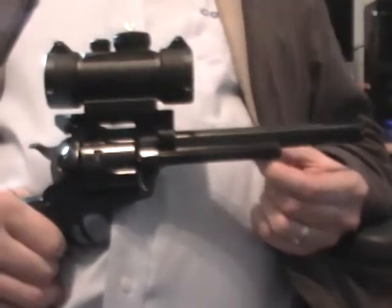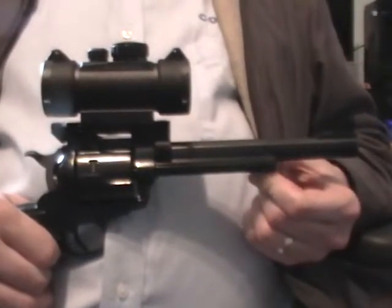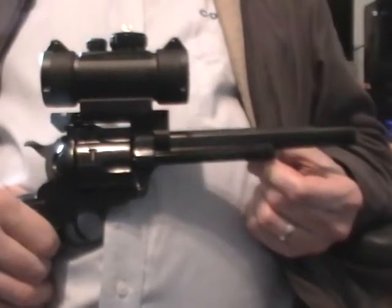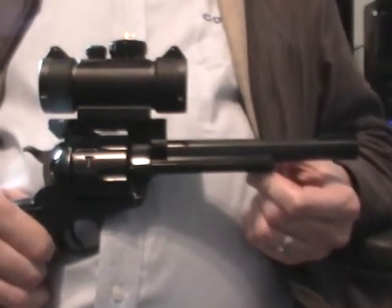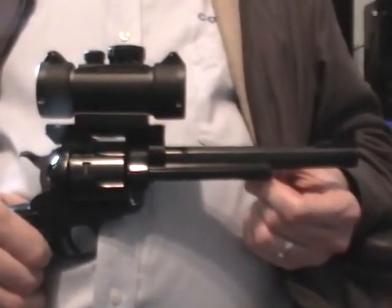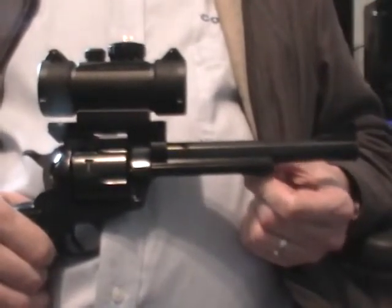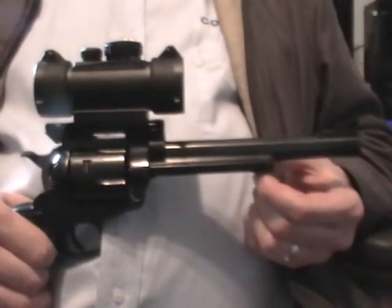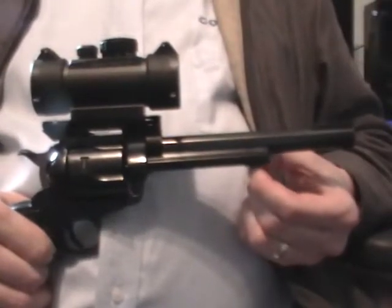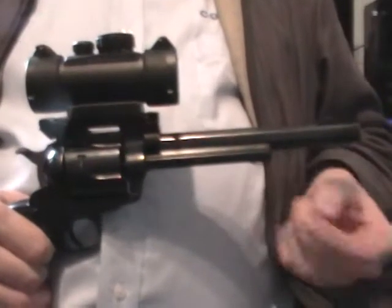So you still can't quite outdo a .44 Magnum even in a modern gun like this, because the main limitation with .45 Colt, if you want to up the power in a strong gun, is the case. The case walls in .45 Colt are not as thick as they are in a .44 Magnum. So it was a gun that was designed for the pressure levels of the day. You can do very well with it, even with the loads that are safe in a Single Action Army, which almost every factory load you'll find will be. If you want a factory load that's more powerful, you're going to have to buy Corbon or Buffalo Bore, or Double Tap, something like that, or hand load, which is what I do.